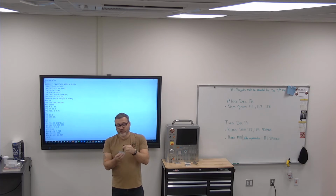So if I go down from 0, 124 thousandths with the same tool, I know I go down 124 thousandths. If I have a 3-inch shell mill and then a couple of different end mills and tools, there can be a variation of a thou or so as I go. For me, when I'm making them, I'll come through and just do this and this at the same time.